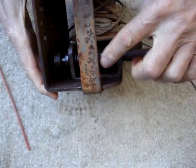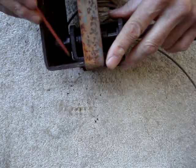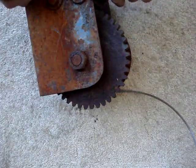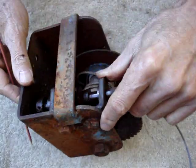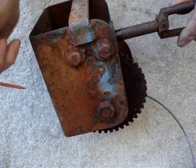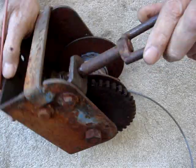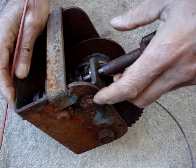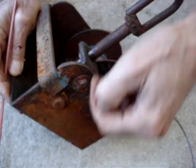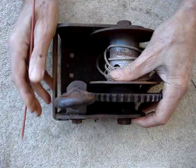So we've got to put a thrust bearing in there and extend that bracket downward about another inch. I'll probably upgrade these bolts — they look like 5/16 national coarse — to maybe half-inch national coarse, of which I've got about 500 grade-fives. The lower bolt could even be a flip latch — some kind of nice flip latch instead of screwing both back in. Have another ear sticking up here with a latch that flips over into a slot.